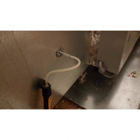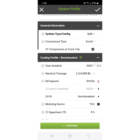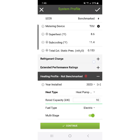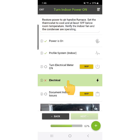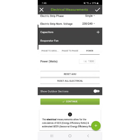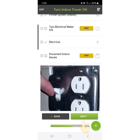For my system, I've got permanent static pressure connections I just need to slide my probe into. Of course, you'll need to drill a test port and use those static pressure probes that come with your Field Piece kit for the most accurate measurement. Even though we already commissioned and benchmarked this system, MeasureQuick is going to ask us to review the system profile again — just in case something was entered incorrectly or something about the system has changed. We'll also verify the electrical information is still correct, then turn on the indoor unit.